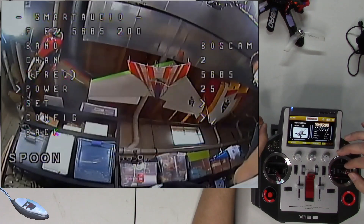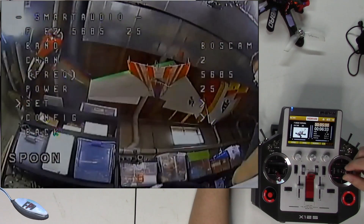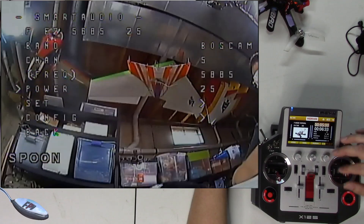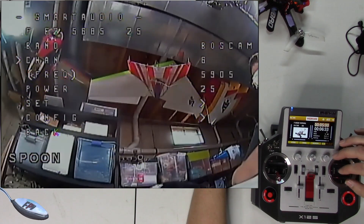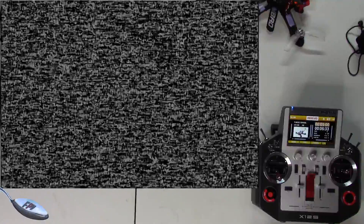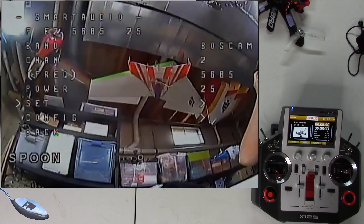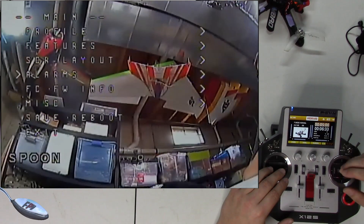I'll leave it like that. My transmit power — because I'm inside I should set it to 25 milliwatts, so I can set all that stuff and confirm. Now it's transmitting at 25 milliwatts. If I want to change my channel, the DVR is going to cut out because it's set to E2, but I can choose set. Let's choose one I actually have in my goggles so I can set it back easy. 5905 I have set in my goggles, so I hit set, yes, and you'll see the DVR will go all fuzzy. I'll switch my goggles to that channel and set it back to the frequency you can see in the DVR. So it's that simple to change your channel, power, everything else on your quad without having to deal with buttons and all the other stuff.